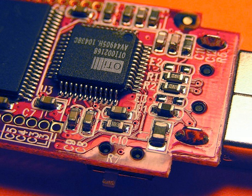SMDs, usually being smaller than equivalent through-hole components, have less surface area for marking, requiring marked part ID codes or component values to be more cryptic and smaller, often requiring magnification to be read, whereas a larger through-hole component could be read and identified by the unaided eye. This is a disadvantage for prototyping, repair, or rework, and possibly for production setup.